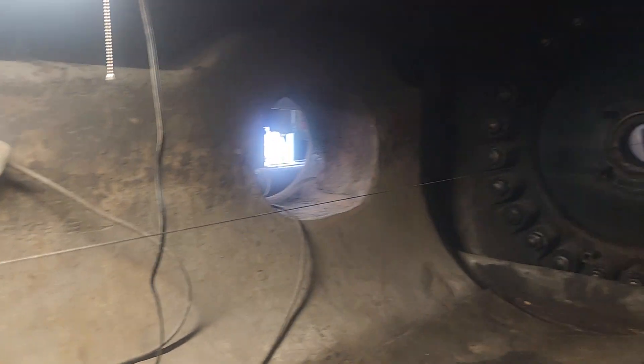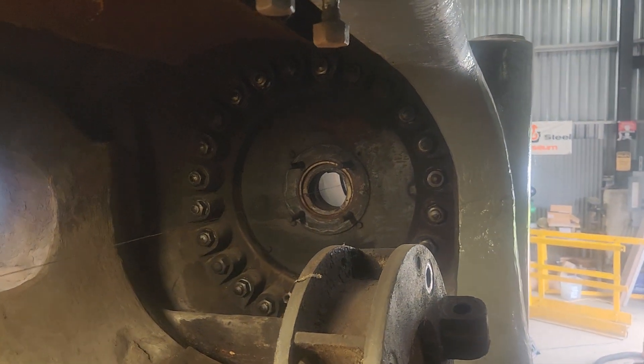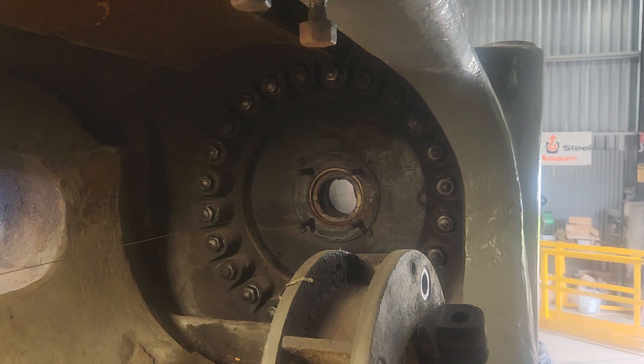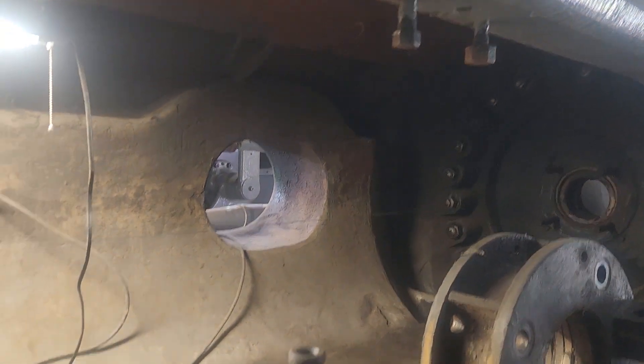Then I cut that in half to 20 inches, measure from the bolt to the wire, and measure from the boss to the wire, adjusting the wire until it's right in the middle. When it's in the middle here and in the middle of the forward end of the cylinder, we've got a pretty good idea that the wire is exactly dead-nuts down the middle of the high-pressure side.